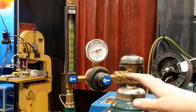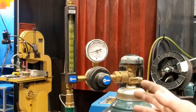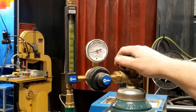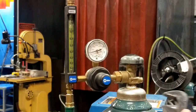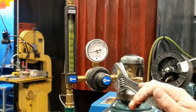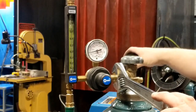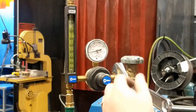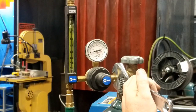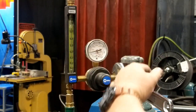The drop check doesn't tell you where the leak is — spray solution is good for that — but it tells you there is a leak. It's not uncommon to have a leak in a gas hose, especially with 100 feet of hose. I'm going to double check my connections. Since I don't have gas hose hooked up it's probably right here — this connection wasn't very tight. If I have difficulty tightening the wrench without the whole thing rotating, I'm going to hold the wrench in the direction I want to turn it and give it a light tap to assist it slightly.